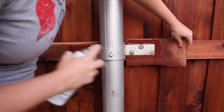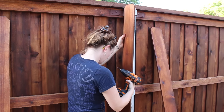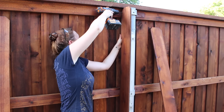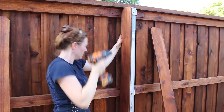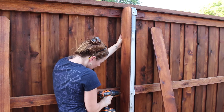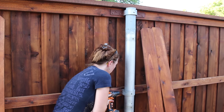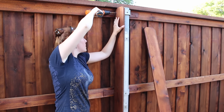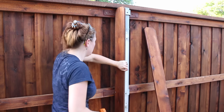To make that step a little bit easier, I cut out a template from some cardboard. We were thinking of a few different ways to attach the pickets to the steel post, and we decided to use self-tapping screws to go directly into the side. However, it was way too much of a bear to drive in the screws without pre-drilling first. So I would hold the picket in place, pre-drill through the wood, and make a mark on the steel post where the screw needed to go in. Then I would set the picket aside, finish drilling the hole, set the picket back into place, and drive in the self-tapping screw. This method was a little time consuming, but it definitely worked well — the picket felt rock steady on that post.